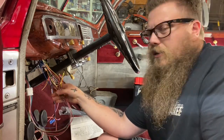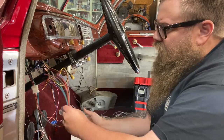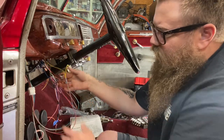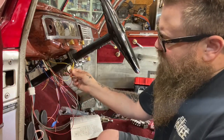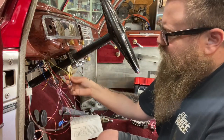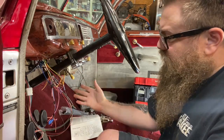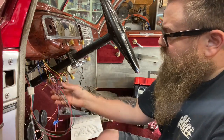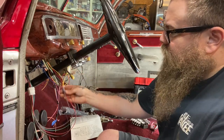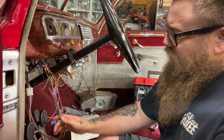Make your best choice for your build. So I have everything wired up here. A couple of these share the same wire, which is not a big deal. One is instrument lights — each gauge has its own set of lights, so it's shared there. There's a shared ground for all the gauges, pretty typical. And ignition is shared between the two — ignition comes in and splits into the two gauges. That's super common.